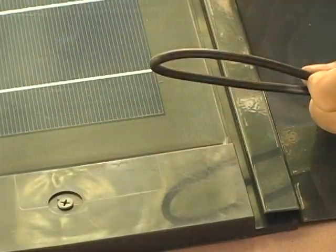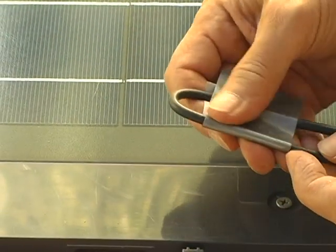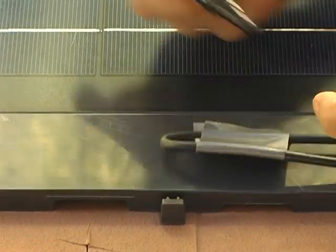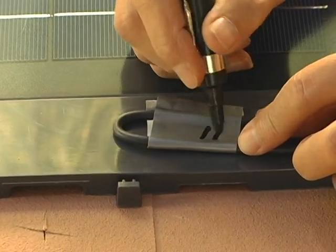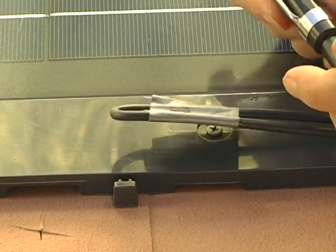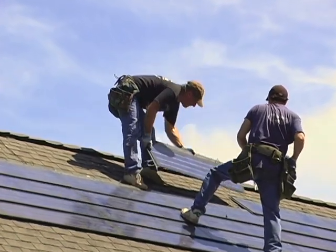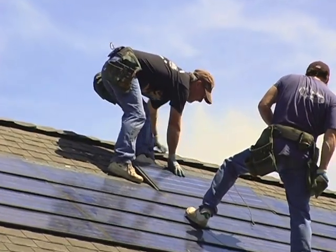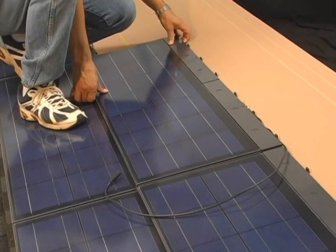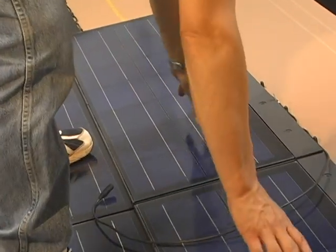Find the midpoint in the home run cable and make a loop. Tape the cables together and label them with the string number. This is where the cable will eventually be cut by the professional who will do the finished wiring. Make sure there's enough cable to reach the termination point under the roof. Sun Energy Shingles have a snow load rating of 250 pounds per square foot, and they can be walked on once properly installed. However, extreme care must be taken — the surface of the shingle can be slippery, especially when wet. Only trained roofing personnel with the appropriate safety gear should walk on the modules.